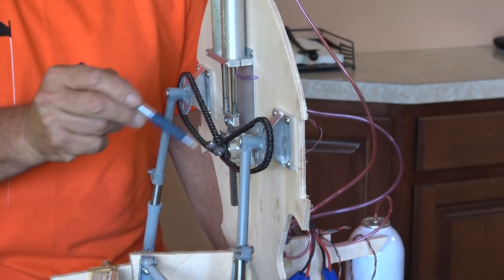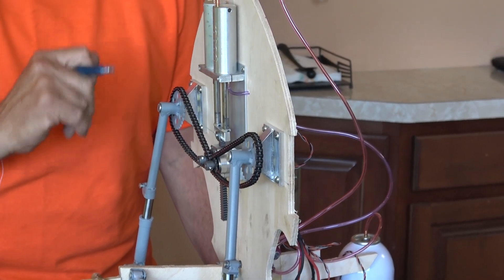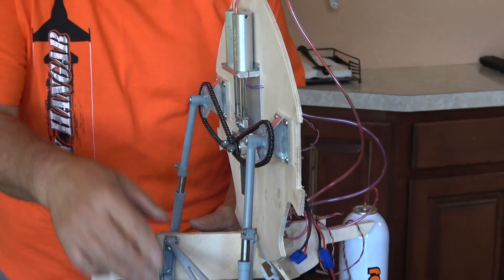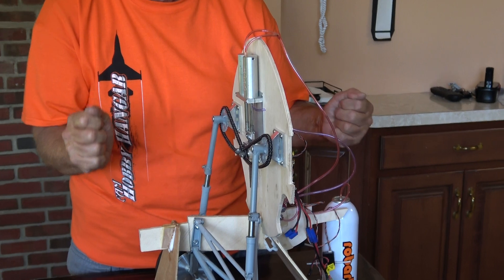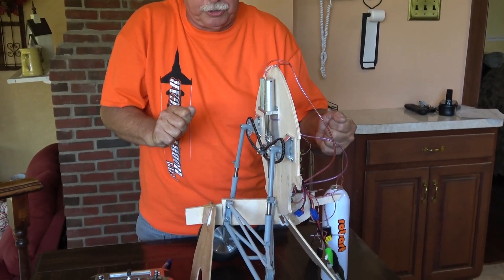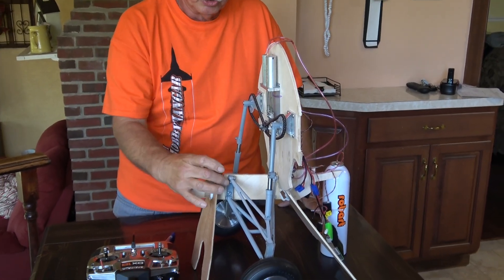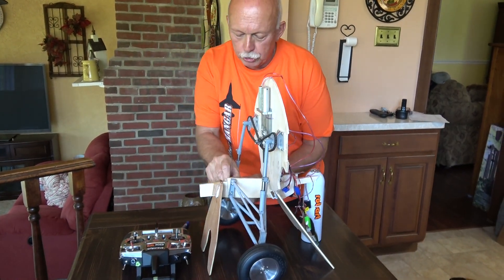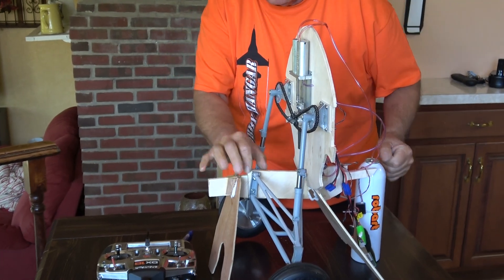So the gear is reversed around here. I tried them again and they were working a little bit better — no chain issues. I was noticing that these were bolted on very tight with no movement at all. As they went up, it was making the wood twist a little bit, so I loosened these just ever so slightly. I'm going to put lock nuts on them to secure them so they can't get any looser, but they move just a little bit now — they've got a little bit of play so as they go up, they can twist a little bit.